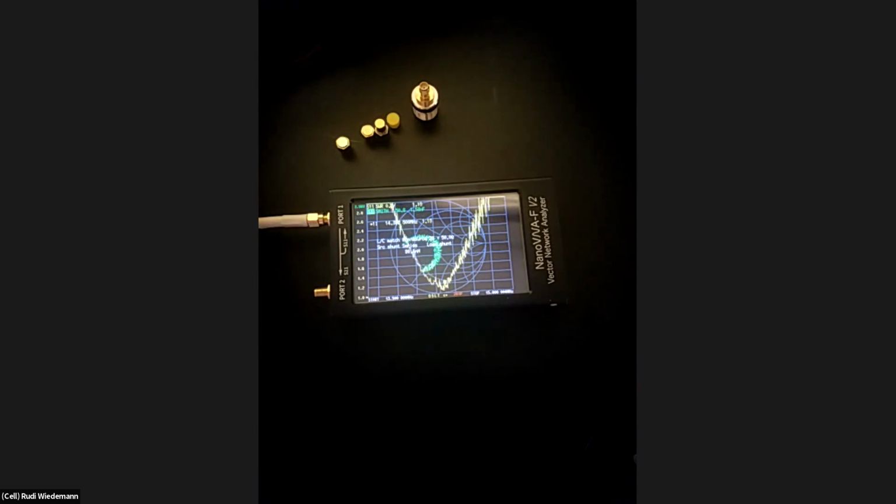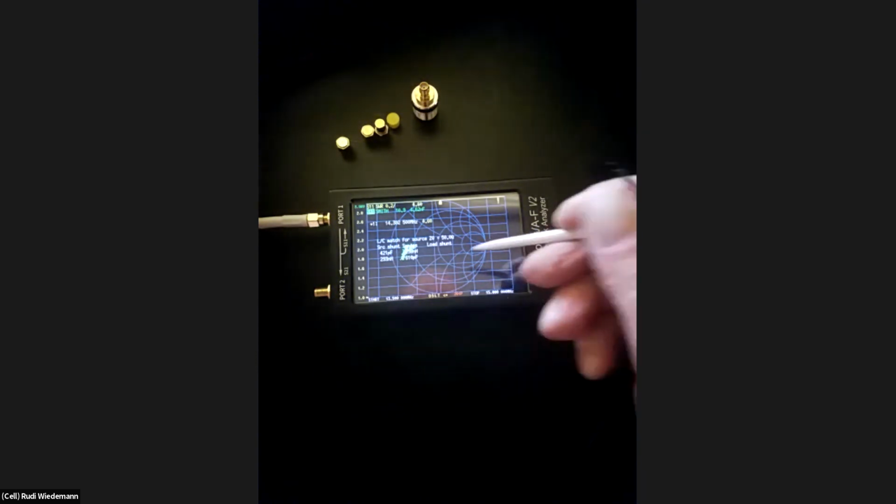Literally. It's a screwdriver antenna, so I'm going to screw it up. Let's go down in frequency, because this is a short antenna and it's going to get tougher and tougher. As I raise this coil and add more turns to this screwdriver antenna system, I'm increasing the impedance, and it's going to take progressively more coil turns to get an extra number of megahertz down in my bandwidth. So I'm probably already off of my 15 megahertz.